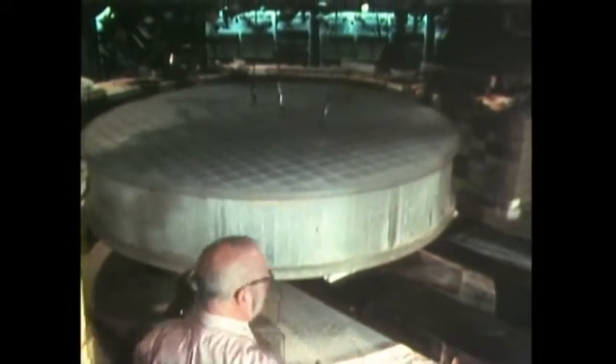To prevent the extremely thin front surface from being cut through during the final grinding process, the entire mirror blank was heated in a special oven and slumped over a template so it took on the approximate shape of its final curve.